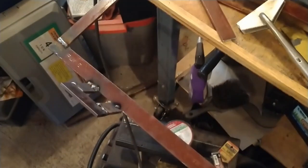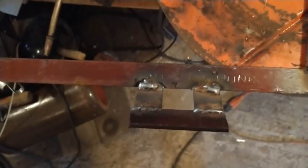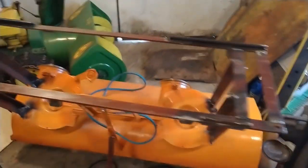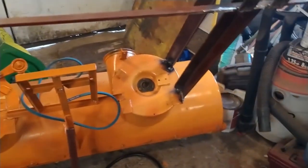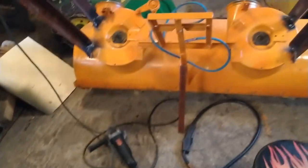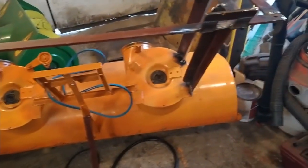Here's the fabrication on the plate that attaches to the bobcat itself — a lot of tedious cutting and welding with little one-and-a-half-inch pieces, a lot of welding and measuring, but I've got it pretty perfect and it fits nicely on the bobcat. Here's the bobcat plate attached to the blower housing — I used some pretty thick, I believe two-inch angle iron. I had to crank the heat on the old 110 welder to get the welds to penetrate, but that thing is not going anywhere.